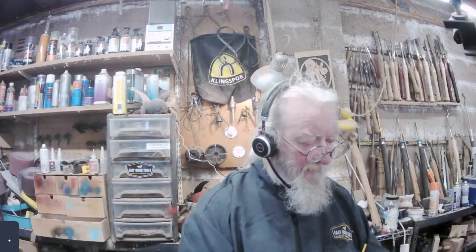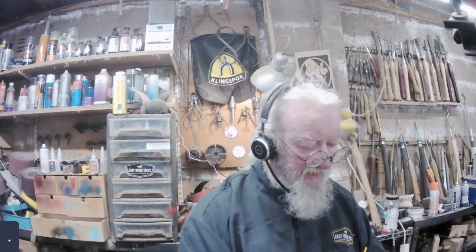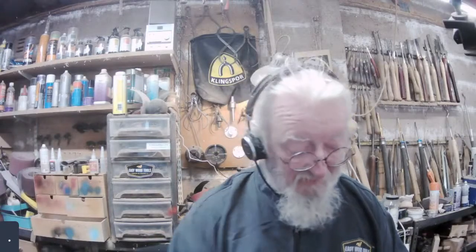Probably a couple of things to do with the breakout. Number one, I probably didn't have the lathe going fast enough. And number two, that one where you broke it out, you went in a bit hard and fast. Yeah, and number two, it is open grained wood. There was just a couple of bits the way it's broken out, which I'm not overly concerned with. This was a bit of a practice piece because I'd never used them before tonight. I've seen them used, but I'd never used them myself before tonight.